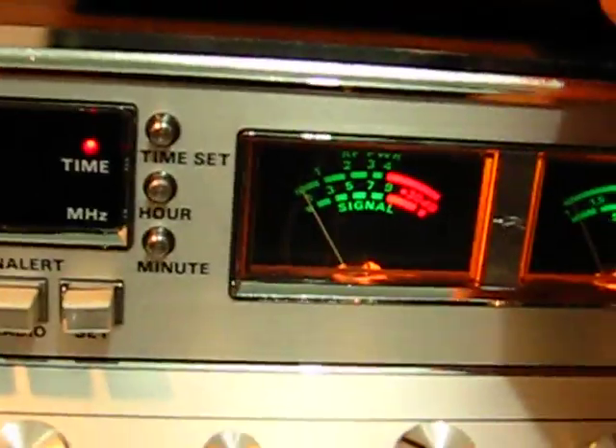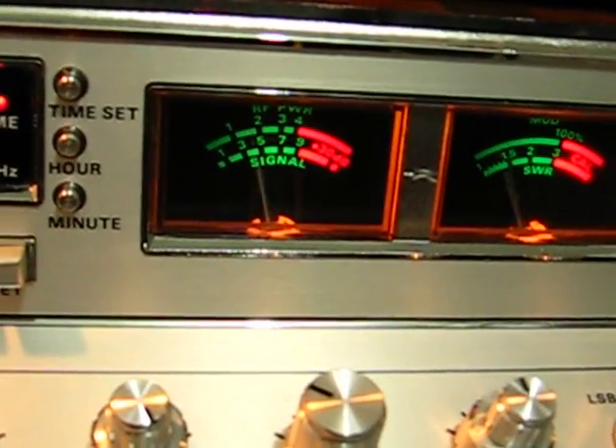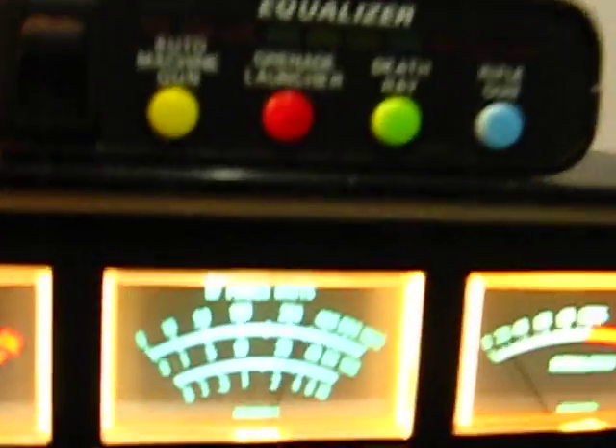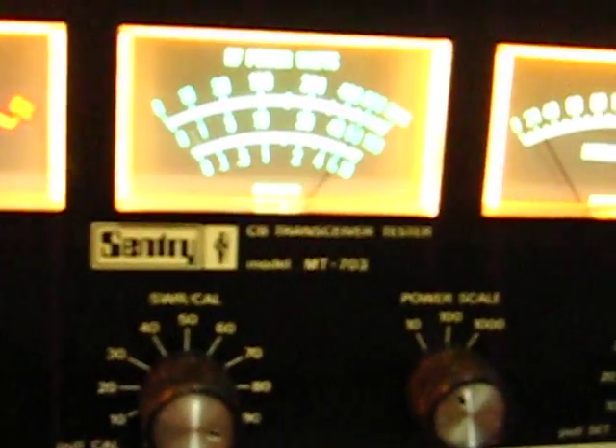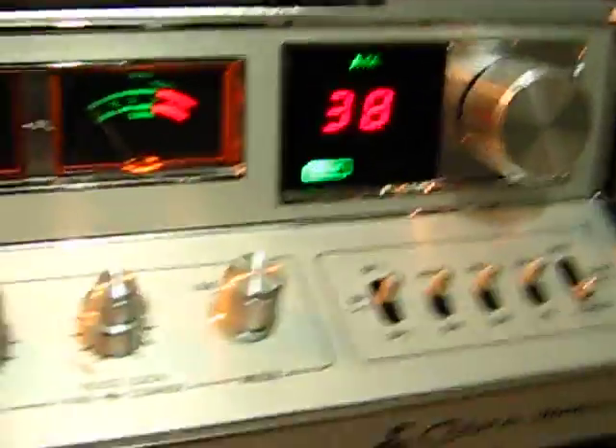I was going to show you the swing on here. That's on AM - I got about a one watt dead key, and I only swing it up to about six or eight watts. I'm sure it would be more if I had a peak reading meter or whatever. The Cobra 148 worked really good with the swing mod; for some reason the Cobra 2000 just doesn't, but whatever - that's plenty enough.